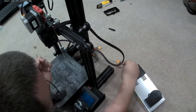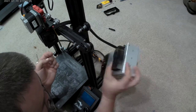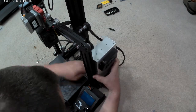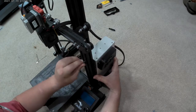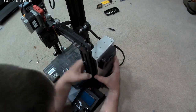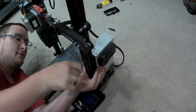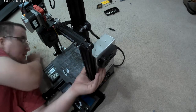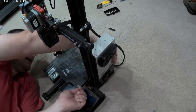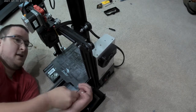So we're going to want to plug it back in to the board. And we're going to want to put it up here in the correct way, which is this way. And slide it right up against here. I'm going to finger tighten, or put it in with my finger. There we go. Got started in a little bit. Don't tighten it all the way, because how are you going to line up the bottom one if the thing doesn't want to move? Go ahead and put in your second one. I never tighten down my bolts until I know they all went in. And again, it's really nice having all this redone because everything went right into place.